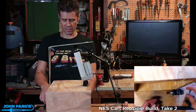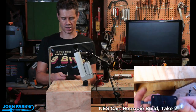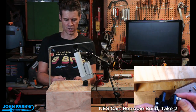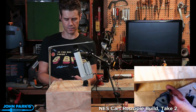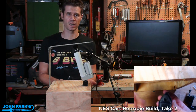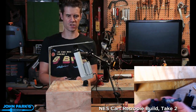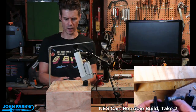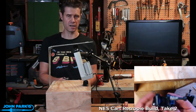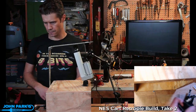It's a pretty cool thing to 3D print, honestly, because that would cost $10 or so for one, just a one-off from Amazon. Probably cheaper if you got them in bulk somewhere or from a Chinese website. If you go to ServoCity, you'll probably spend 10, 15 bucks per. And since this is pretty light duty and I'm not moving any huge weight, a 3D printed PLA part is pretty great for this sort of thing, and you can make it exactly as you want.